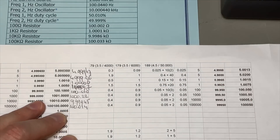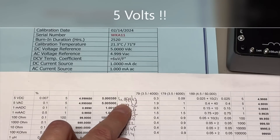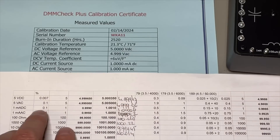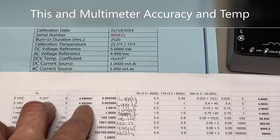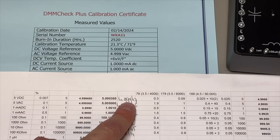And why is the voltage not exactly that? Well the temperature here is not 21 or 23 degrees — it is even close to 27. But also we have the 0.007% tolerance, which means it can be within that range, and it actually is.